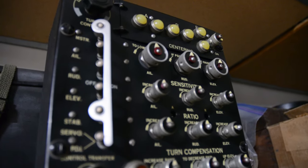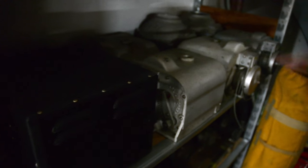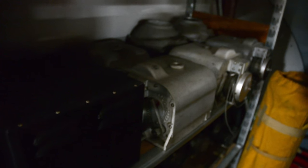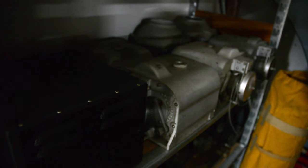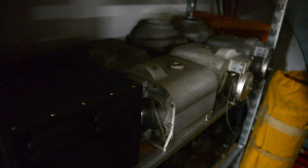When you turn it on, it activates a gyro located in the airplane's center of gravity. This was pulled off a combat veteran in Belgium, so it didn't need restoration. The gyro feeds information to an amplifier, which is connected to three servos. Each servo acts for pitch, roll, and yaw — they tug on the cables to hold the airplane level.